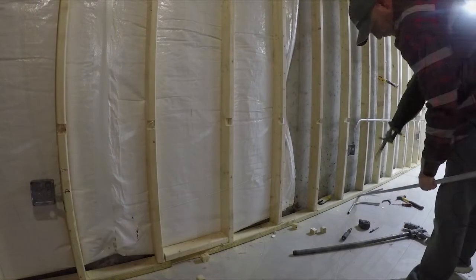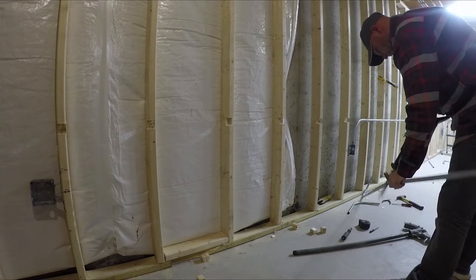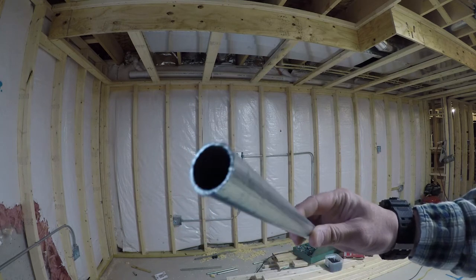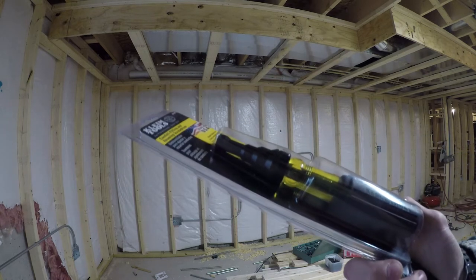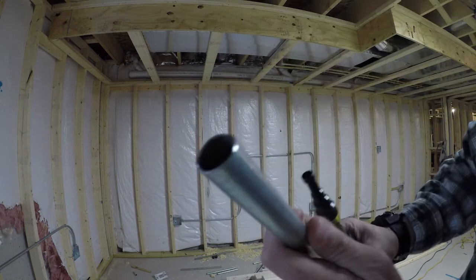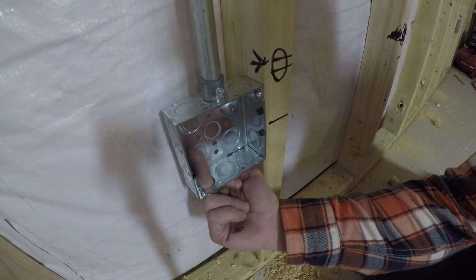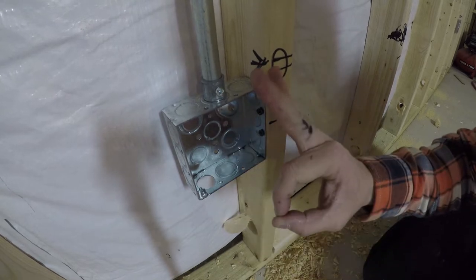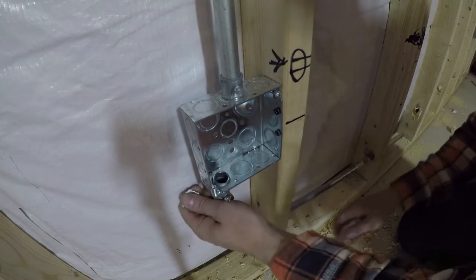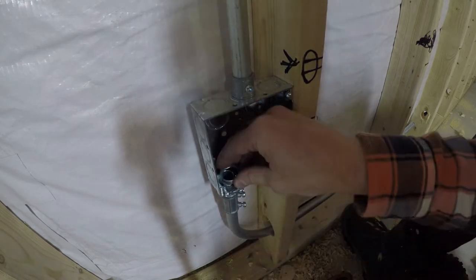You may say I suck at this, but after messing up about half a dozen times I got the hang of it — this just takes practice and there's no way around it. When cutting the conduit you're going to get really rough edges, and if not cleaned up you might slice your wires when pulling them. To clean it up I got a reamer — this one's made by Klein, I'll put a link in the description — just ream that pipe real good and it will take all those little shards off. Then use a screwdriver to punch out the electrical box knockouts, put your conduit connector through the knockout, tighten everything down, and make sure that ring is nice and tight.